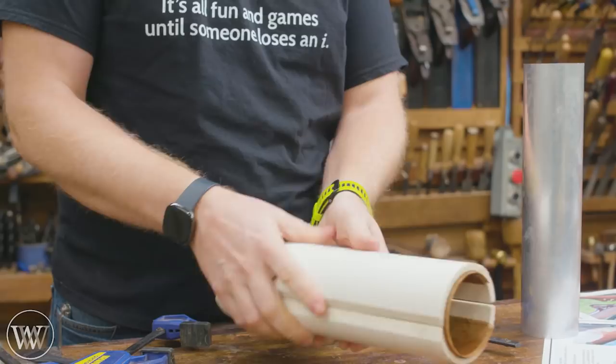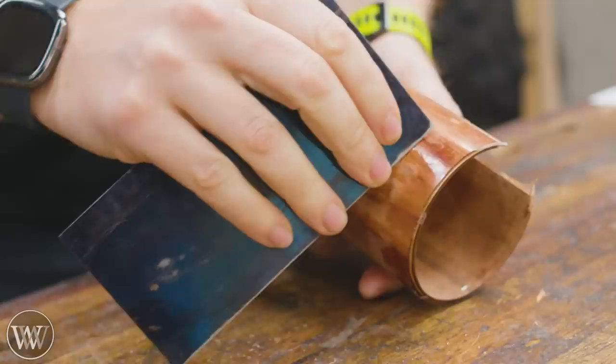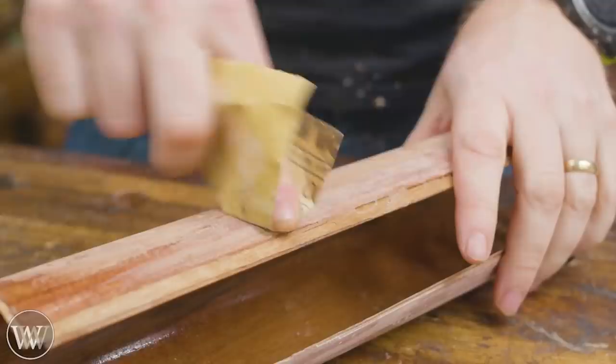And it is really surprising to me how strong and structural these actually are. They are incredibly strong and stiff. So if there's excess epoxy on here, I come back and scrape it all off. We want to get a nice clean surface on the outside here. And the scraping allows you to cut through the epoxy very, very quickly. I found I got some excess on the outside, and I didn't always get excess on the inside. I actually got a really nice clean surface on there.